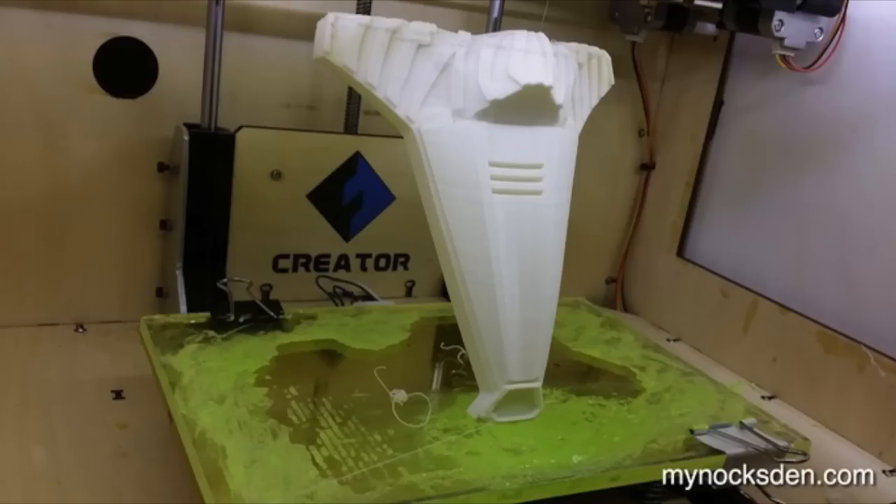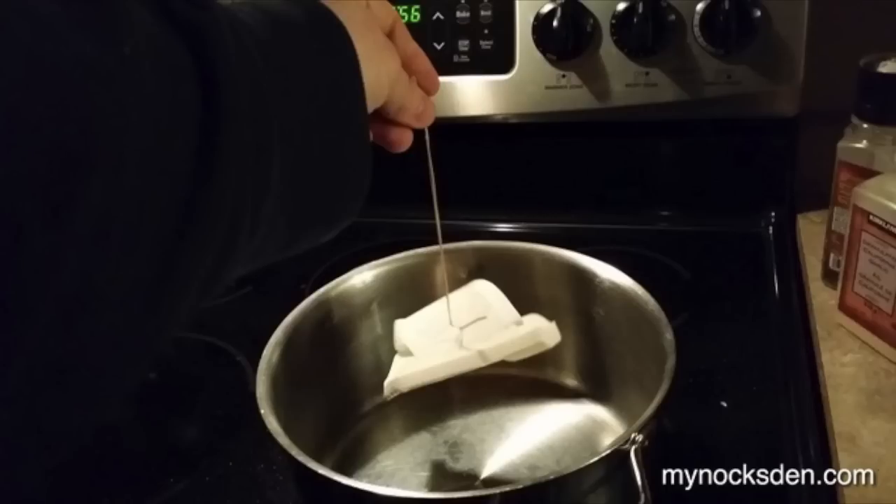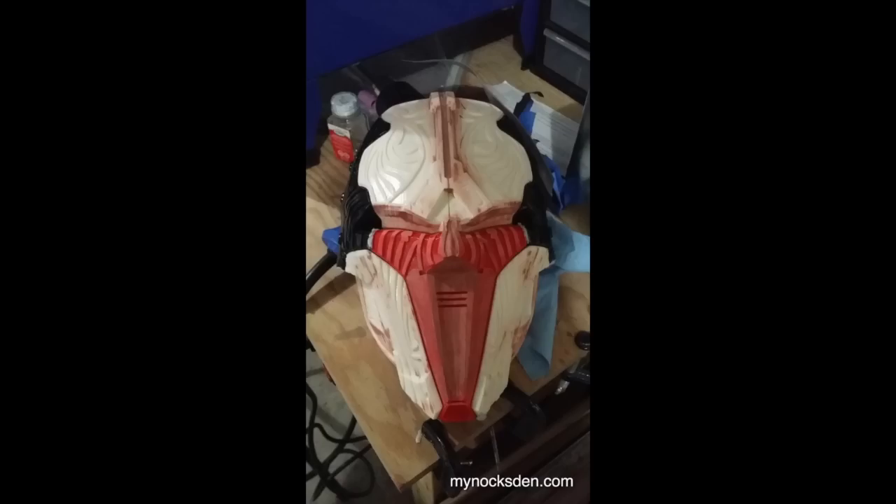After all the parts were 3D printed, I used a process called acetone vapor smoothing to smooth out the plastic and get rid of the 3D printing striations. Acetone vapor smoothing can be done at home, though some caution is required. I take a pot, pour some acetone inside, and put it on the element. Acetone boils at 56 degrees Celsius, so I recommend having your fume hood on, a central fan running, and wearing a respirator. As the acetone boils it generates vapor that rises, condenses onto the part, and melts the plastic sufficiently to eliminate about 90% of the striations. It's not foolproof, so some sanding or fillers like Bondo spot putty are still required afterwards, but acetone vapor smoothing is very effective for getting most of the work done.